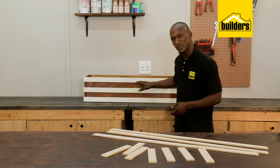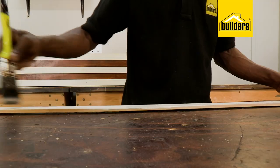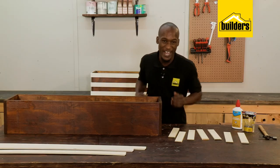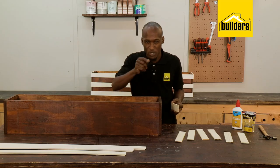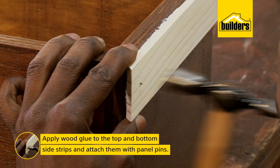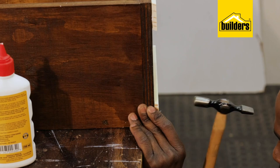I really like how the two colors contrast. For the timber strips, I'm going to be using Fired Earth Woodworks in a whitish color — same as before, paint with a brush. The box and strips are dry, so I can now attach the painted strips onto the box, making sure that they flush with the top edge. Run a bit of wood glue and give it a quick smear before securing with panel pins. If you have any glue seep out, just wipe it with a rag. Do the same for the bottom strip.